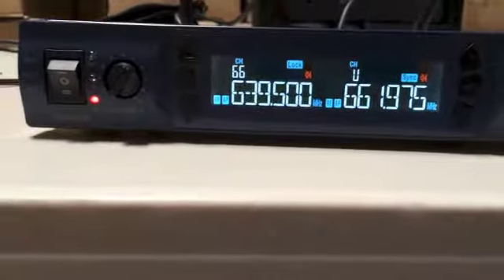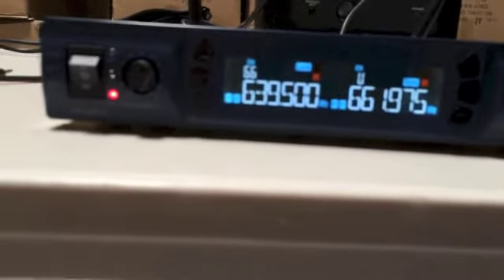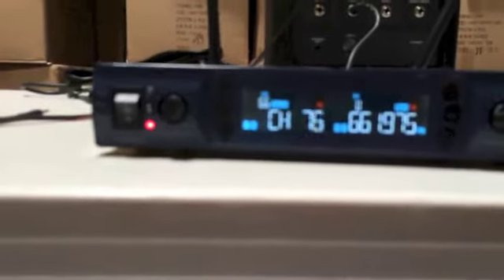At the face of your receiver, you'll see the little on switch here — put it down to the bottom and it'll be the DC, which means the plug, and you're going to see this display pop up. One feature I really like is it has a ton of different frequency options. If you're out and about enough, you're going to run into different frequency problems. You'll see little buttons on the side — scroll up to search, click the select button in the middle, change it to yes, then click it again. It's searching for the best channel. It's got 99 channels and runs through all of them twice to decide your best channel. Basically, it's telling you what is the cleanest channel in this room right now. It'll probably be fine from the minute you take it out of the box, but now you know how to do that.